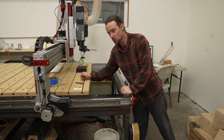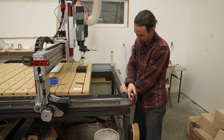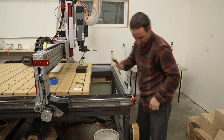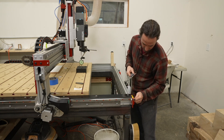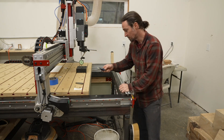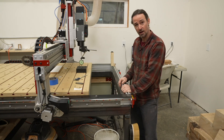Once you have your spindle trammed, the next thing to ensure is that everything is square. That's done by adjusting the sensor positions — the two on the side of the Y-axis. The way I did this was ensuring the little red plate wasn't pushing out by hitting the linear rails, and I used my micrometers to measure the distance and set them to exactly the same value. By doing that, assuming my table is very square, I was getting really good cuts right off the bat.